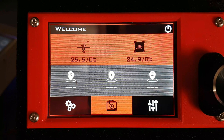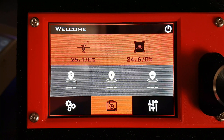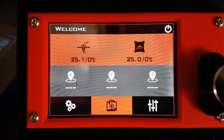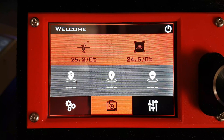I wanted a controller that was completely self-contained, did not require a computer at all, and also did not require any kind of configuration — no messing around with text files or Arduino uploading. If you want to update the firmware of this, you just put it on the SD card, plug it in, restart it, and you're done. There's no Arduino programming and no configuration files required. Well, you can use a config file if you want, but that's really for companies wanting to quickly set up many units identically — it's not required.